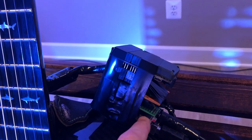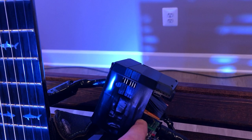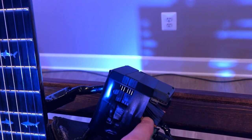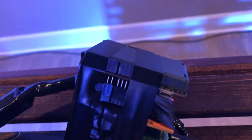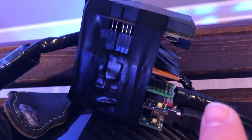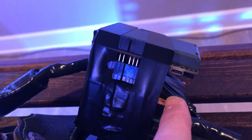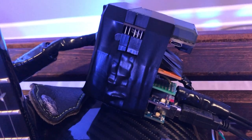Here's how it all works. At the bottom is the Arduino, then an MP3 player that can be triggered with a button. There's wiring to jump things and also to send to DMX. This is the DMX player — that is the standard that runs lights and sound. You can see the little wireless module; that little red flashing light says it's sending signal out. The top thing is a battery pack — the Energy Shield Pro 2 from Nightshade. The DMX shield is Tinker DMX, and the MP3 board is from Adafruit, and of course the Arduino is from Arduino.